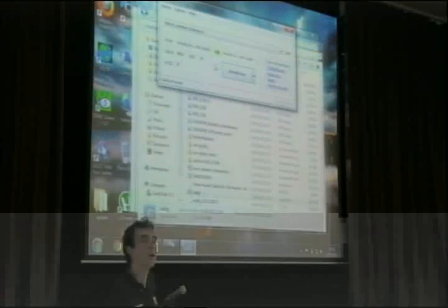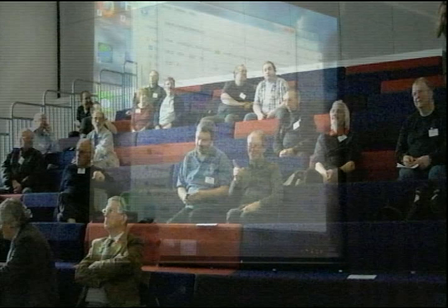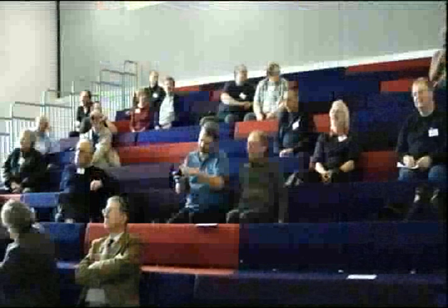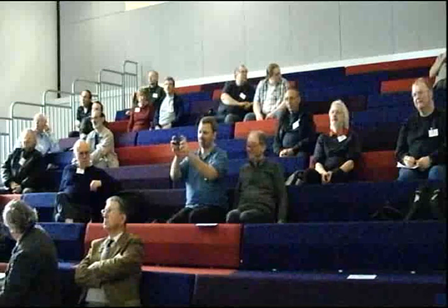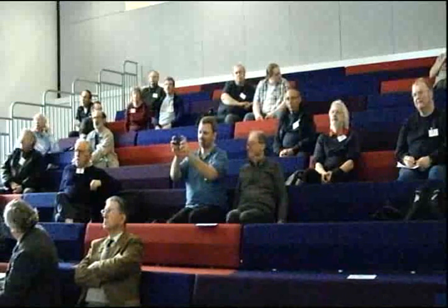One question on that. When I was trying to set this up over many, many weeks, I could never get the Bulk-In Interface to ever appear. It would recognise the device, but it would never come up with that. Even with the latest version, it didn't. But what I've found, and I think Noel found the same thing, is that if you just select the device, the actual RTL itself in there, then it does actually work. Whereas originally when I tried that, it didn't. So something has actually changed there. But yeah, the Bulk-In one never did appear.